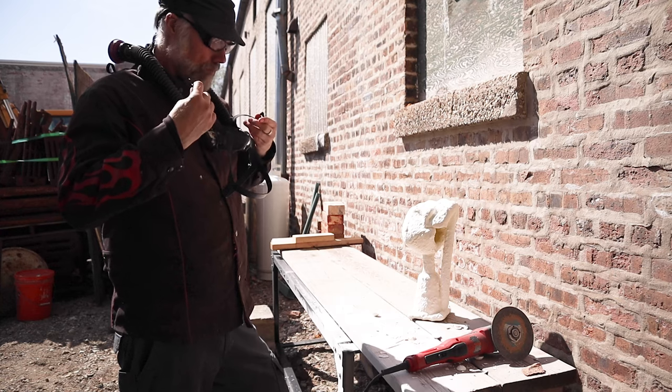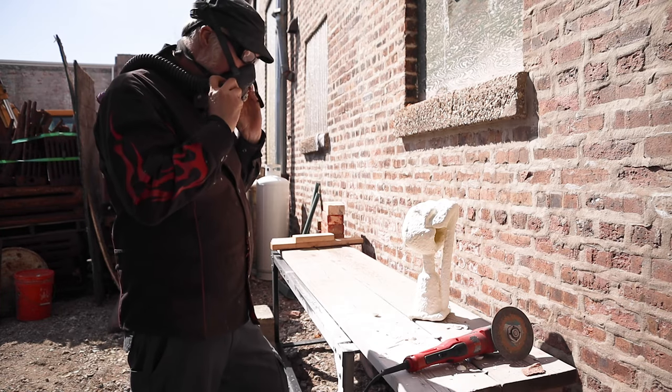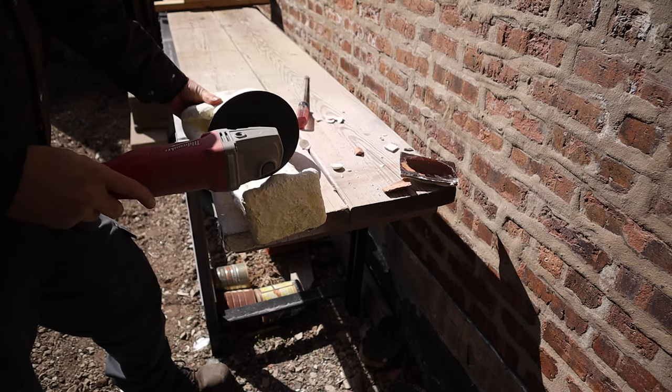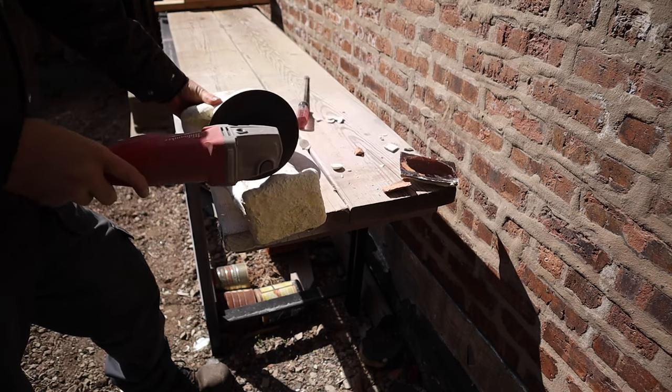Now, the one thing people might do, with the lids and everything, is they'll want to cut the cups off, literally opening it up and going around the circumference of the top of the cup. What I've found is that, in particular, because I use square cardboard to create myself a little bit more of a footprint so these things will balance, I actually want to take advantage of that. Where they were first balancing on the drying rack in the shell room, now I need them to balance in the center of the burnout kiln.